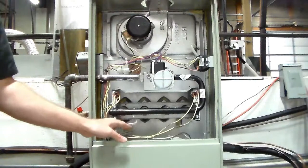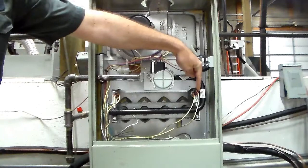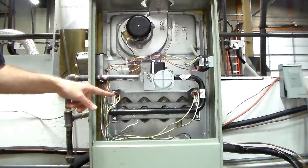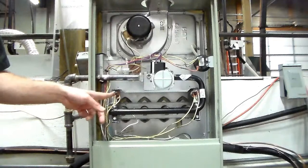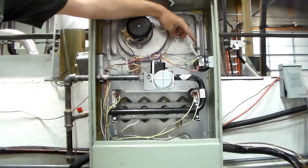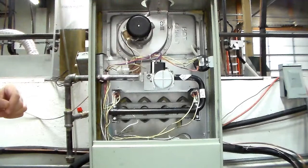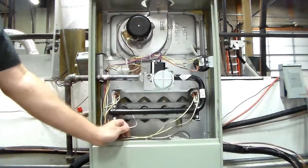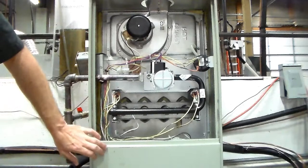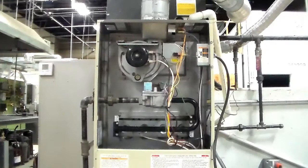The one-wire thing in the burner is the flame sensor; the two-wire thing is the igniter. So we've got: door switch, flame sensor. Coming up, there's a switch on the face of the burner and another on the other side with a reset button — those are your rollout switches. Round with a hose on it and wires going to it — that's your pressure switch. Back on the firewall is the tan-brown high limit. These are always in the same locations.